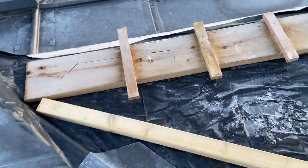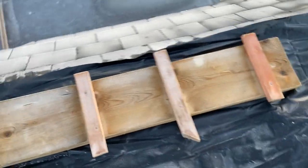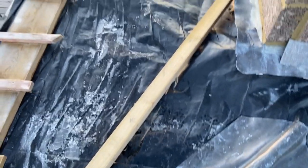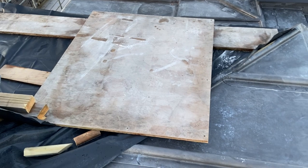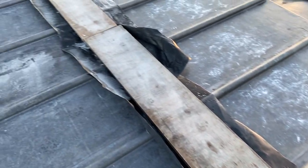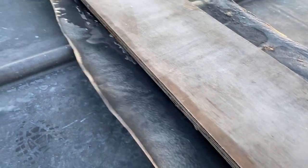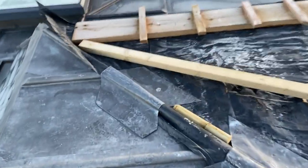What we've got to do now is concentrate on these two end parts and getting the bays in both sides of this chimney. Also we've got a bit of a vent just to finish off through there. We'll get all this timber off here, get these black sheets peeled back, start setting out the wood rolls and start getting some bays through here. Then we've got the same detail this side as well - get the bays in on that last corner and the other side of that chimney. Then we just need to concentrate on getting this ridge line through underneath here, take all this ply off and this sheet, still got a lead ridge coming all the way through there with all the caps over the rolls and running up the hips as well. We'll start on this side first and then just work our way slowly through there.